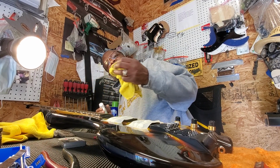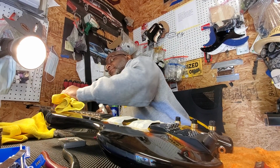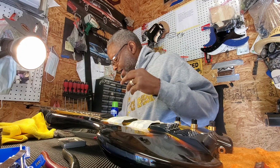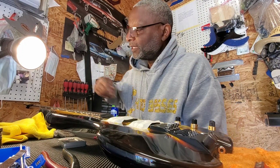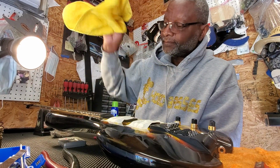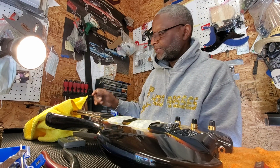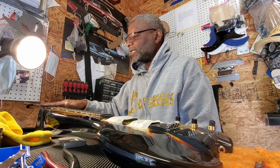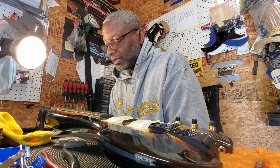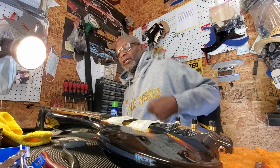So my fretboard's supposed to be clean. This stuff is pretty strong. So if I do that, wipe it off, let it dry. Normally I take tape and tape all this up right here. But I'm going to let that dry for a second, and once it's dry, I'm going to steel wool it again. But right now I can check my fret ends, and they all feel good.